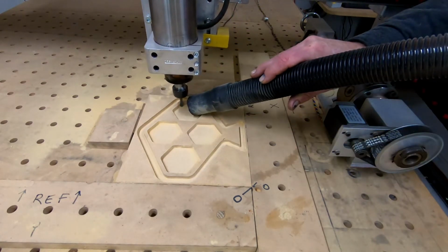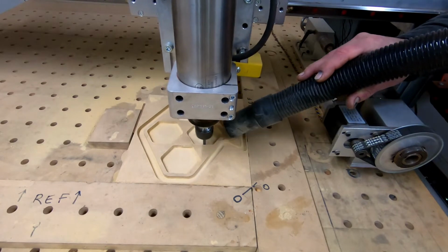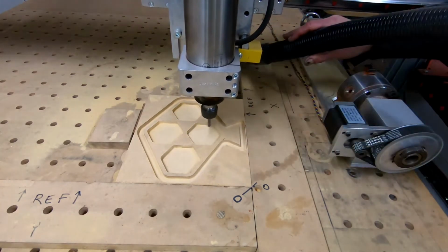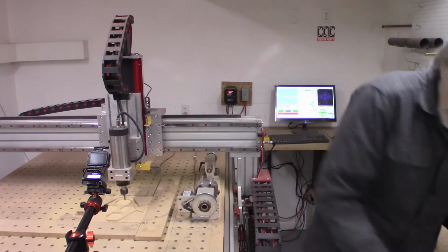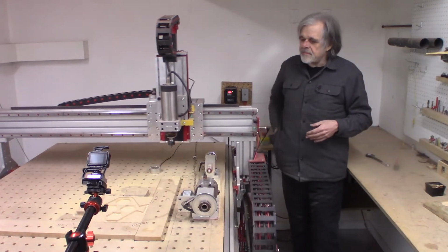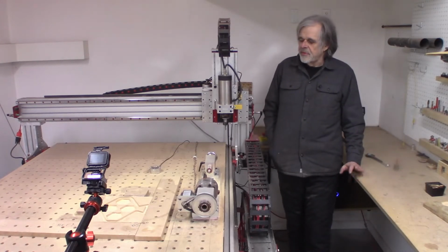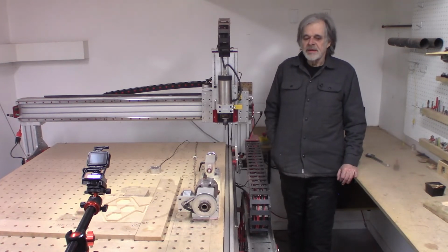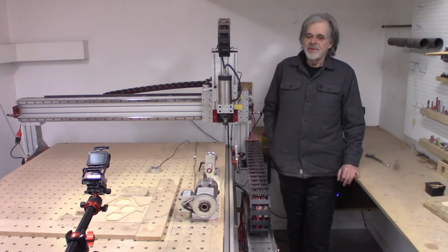Well, so far everything is going well. When I create a toolpath on the CAM system on Bobcad, it has a graphic simulator built in, and I always simulate toolpath before running it, so it's usually pretty successful. When I make mistakes in toolpath, it's usually running into fixtures, running into hold down screws, getting the toolpath wrong, getting the work offset wrong. I've actually started putting cross checks into my G code so that the G code, at least on the mini mill, checks to make sure that the measured work offset is what's expected. So I've got a little bit of an idiot proofing there.